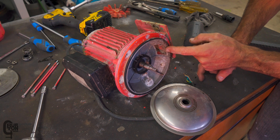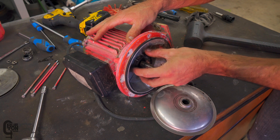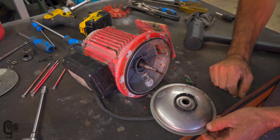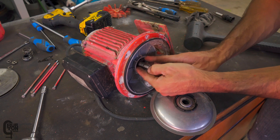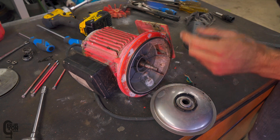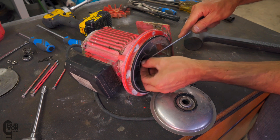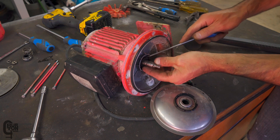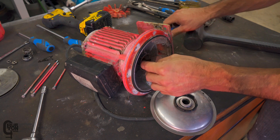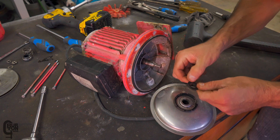You can see there's not much behind the front plate — there's a little drain hole at the bottom. If water leaks past the seal it runs out and down. This is the bottom of the pump; the pump's just lying on its side. We need to pull the shaft out from the centre. There's also a little rubber washer and a rubber seal on the inside here. We'll carefully pry that off — we don't want to damage these things because it's not often you'll get spares for them. It doesn't look like there's anything wrong with them, so we don't have to replace them.